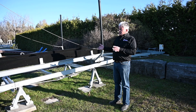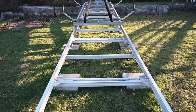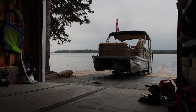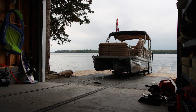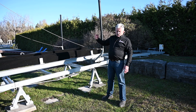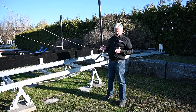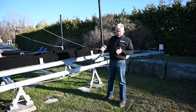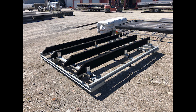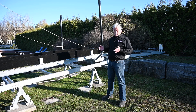Another thing we do now is a lot of people are going to pontoon boats, so we have a special wide carriage. Basically your pontoons will sit in here — this carriage here is too narrow. Your pontoons usually are about eight foot to eight foot six center to center, so we size the carriage out so we can put the bunks in there. We're also running into wakeboard boats, so you have to have a raised bunk so you don't clip the fins on the bottom of your wakeboard boat. And a lot of people are wanting to do double sea-doos. For double sea-doos we basically go to a pontoon boat bed which is wide enough and put two sea-doos side by side. Some people say they want to put them in front of one another, but the problem is to get the front one out you've got to get the back one out first — and since everybody has their own sea-doo they're used to, you're going to want to put them side by side.